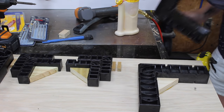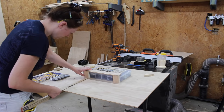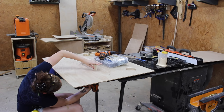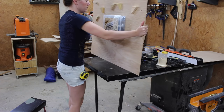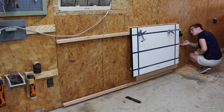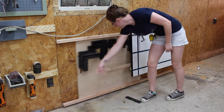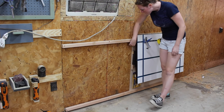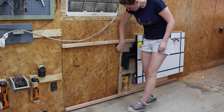I did come back and nail on a small rectangle onto the back side of each one just so they wouldn't fall backwards off the triangle, and this ended up working out great. For the container that holds all the T-track accessories, I used a folding ruler to get a location on the top of the surface and then transferred that mark to the underside so I could attach it from the back. I did a test fit on the rails to make sure my measurements were correct and that it wouldn't interfere with the workbench when folded down — and it didn't. For the packaged things I just ran a screw in to hang them off of, so again, nothing fancy.